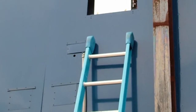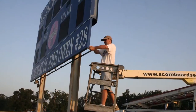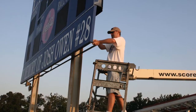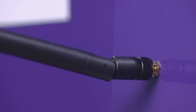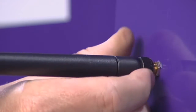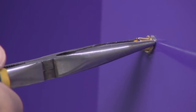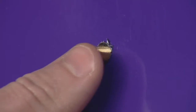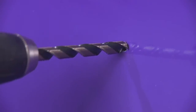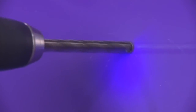Carefully place your ladder, scaffold, or lift so that you can access both the front and back of the scoreboard without scratching or denting it. From the front side of the scoreboard, remove the existing wireless antenna and lock nut. Unscrew the antenna and use the needle nose pliers to carefully remove the nut holding the receiver in place. Now carefully push the receiver back into the cabinet. Then use a cordless drill and a 7/16 inch drill bit to enlarge the existing hole for the new antenna.